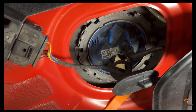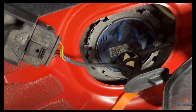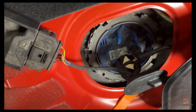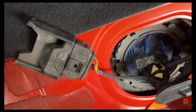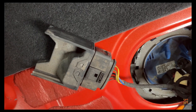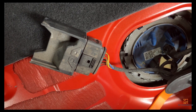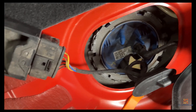I had already done a check on the cabling — it took me a bit of time, and the cabling was okay, so there is no short on the cabling itself. So the first thing I'm suspecting is either the pump or that control unit. I'm going to give a thorough check on the control unit itself, and if it turns out okay, then the pump is the fault.